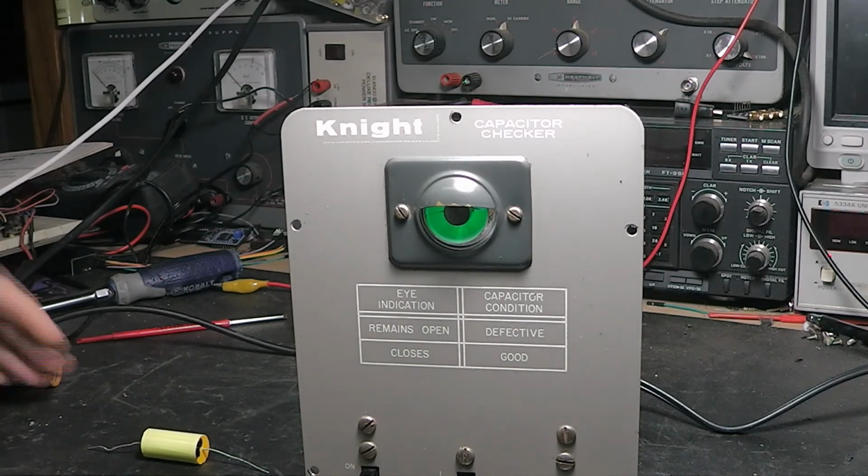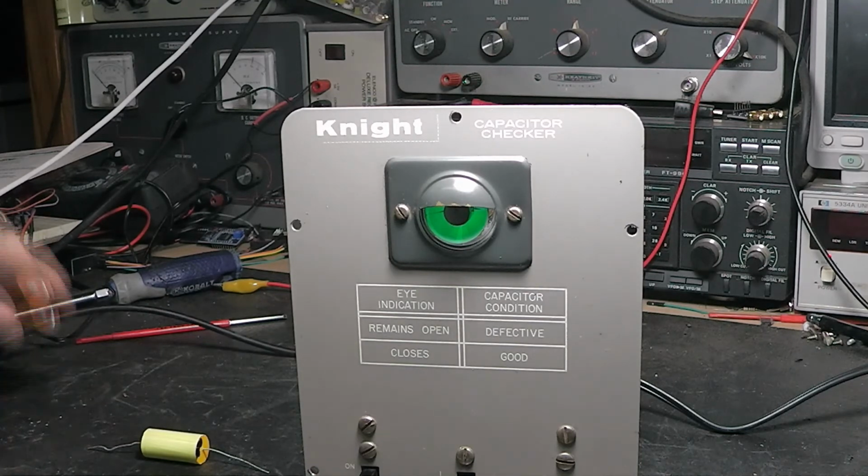that's a little tip I've always told people for years. If you watch my channel, you watch Paul Carlson's channel over there at Mr. Carlson's Lab, he keeps telling the same thing. I'm like, yes, somebody else gets it. It's not the type of capacitor it is. It's because the capacitor's old and starting to leak internally.